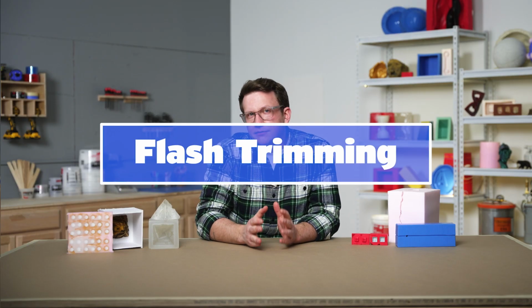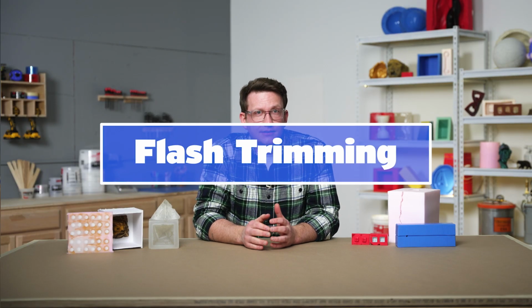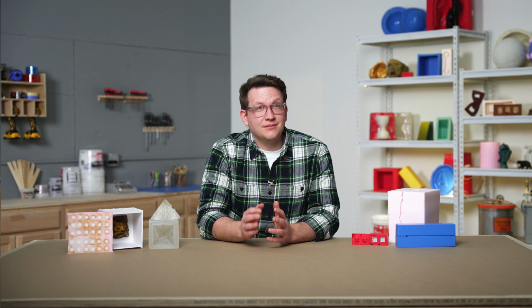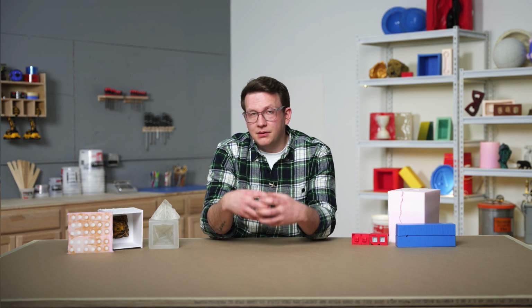With our mold now in front of us, we can look at the base of our master and see if we need to clean up any silicone that may have leaked under. It's important that we remove this extra silicone since it may either hold our master in place or could affect our future castings. Let's look at how to remove this flashing easily without damaging our mold.